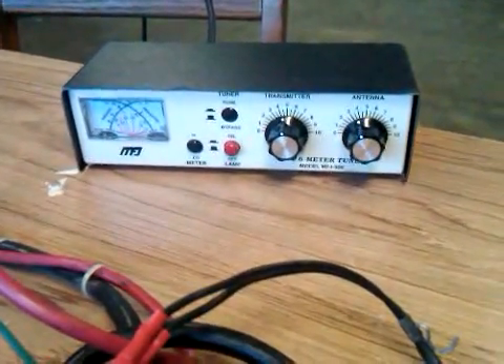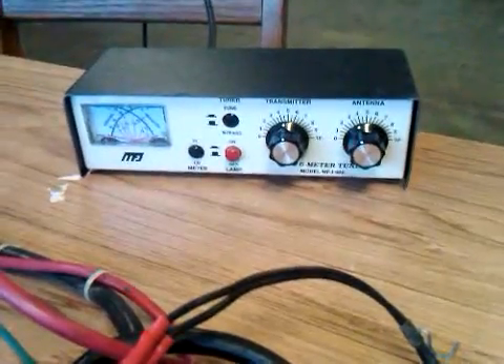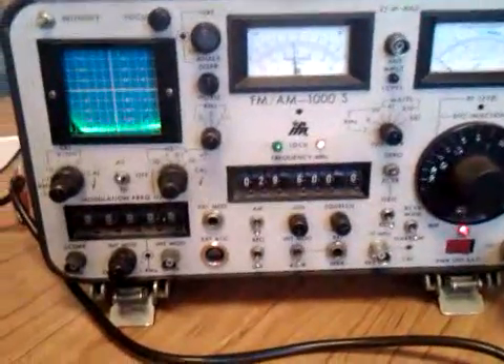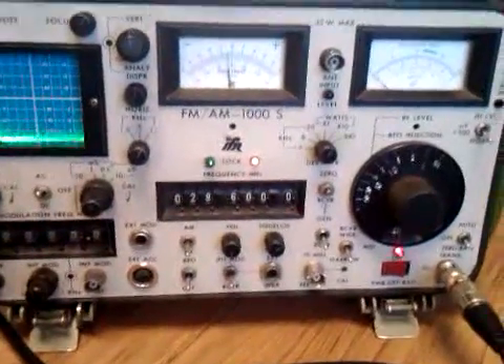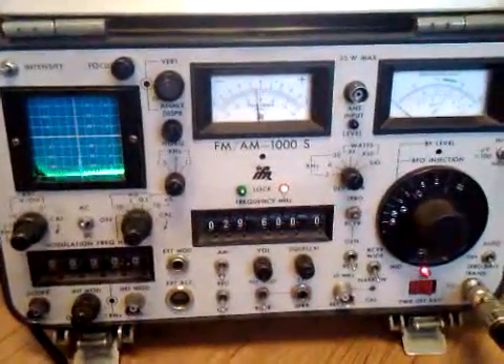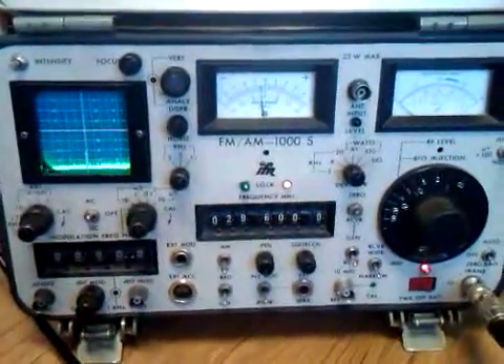You can go across the whole low-band spectrum with it and tune an antenna if you're field tuning. The most important piece of equipment is a service monitor. I've got 29.6 megahertz programmed into this radio, as well as 52.525 — you can do both ten-meter and six-meter frequencies, both simplex and offset. So let's go ahead and test the receive on it.